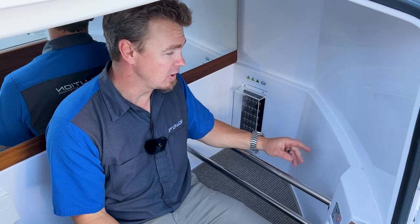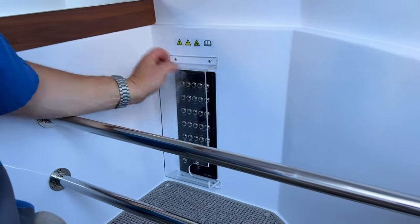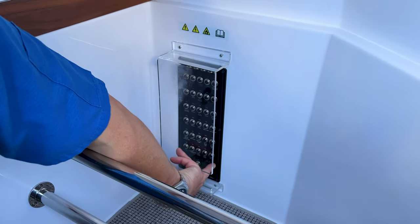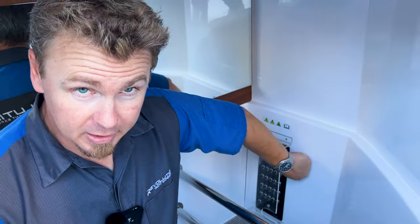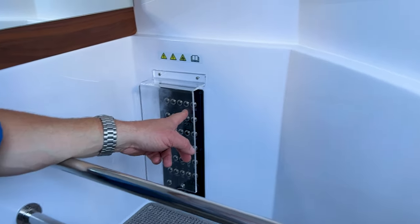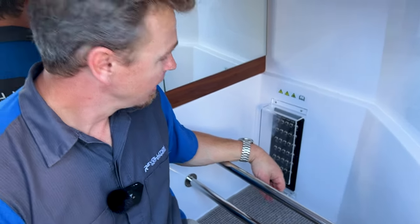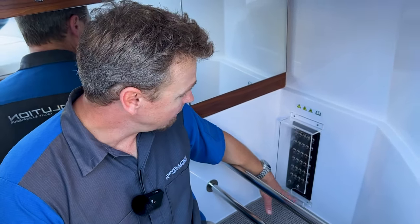Let's do a big sweep around the head cabin. Over here we have the main DC breaker panel. These are pop-out fuses — a fusible link in a circuit that will pop out if overloaded. Generally if there's a problem it'll pop out; if you're lucky you can push it back in and keep going. If it keeps popping out, the equipment with the corresponding label will need to be inspected by a professional.